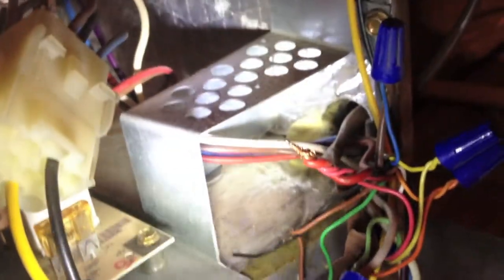I looked a little deeper here. I pulled the thermostat wires all out, and you can see here we are missing a wire nut on our 24-volt thermostat wire. Thinking it probably obviously sparked to ground. When I pulled the rats nest out, I found the wire nut.